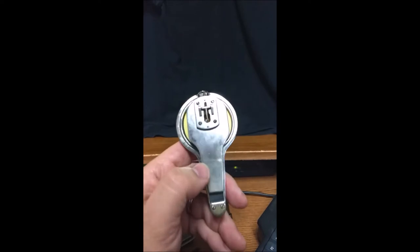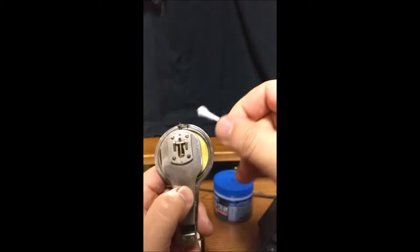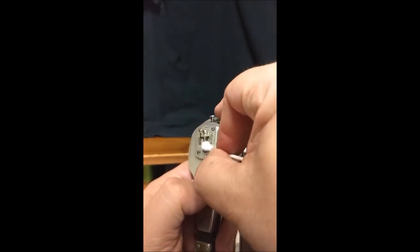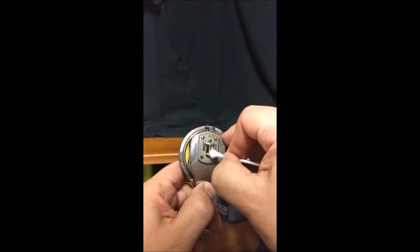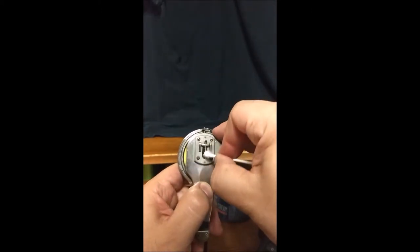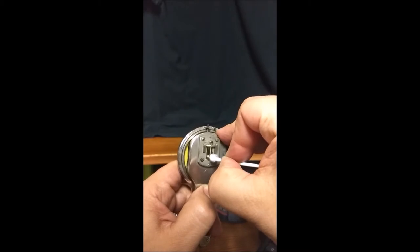Next, get some q-tips and metal polish. You're going to dip your q-tip in — there's your diamond disc stylus bar, the needle bar. You're going to polish that needle bar. Put the metal polish on, leave it on there for a couple of minutes, then get a clean dry q-tip and scrub it off, and finish it off with a lint-free cloth. That'll shine that stylus bar up and improve the volume and the sound traveling from the diamond through the bar, through the diaphragm, through the phonograph, and out the horn.